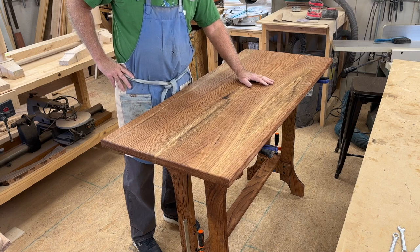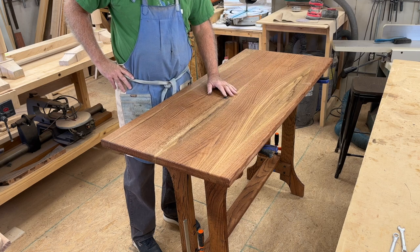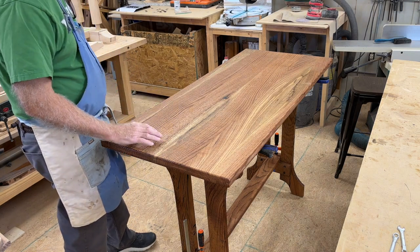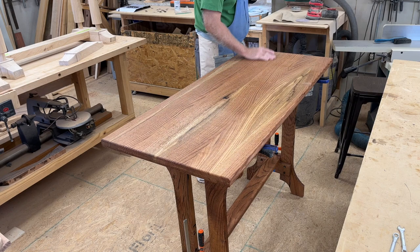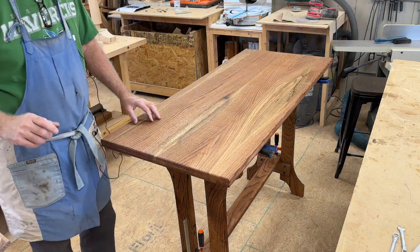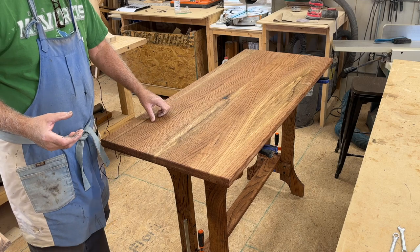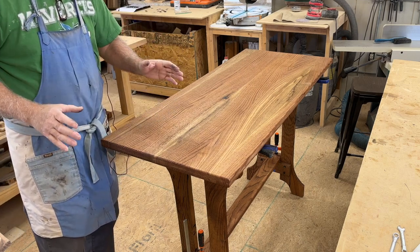They'll be arranged like that. This is red oak and we were fortunate — a member had a neighbor that had a red oak he was cutting down and we were able to gain access to that lumber. We had it dried. The challenge was we had it vacuum kiln dried, which is a very fast method, and some of the thicker parts of the wood — for example the eight-quarter — had honeycombing. That's a process where the inside of the wood splits because it dried too fast.